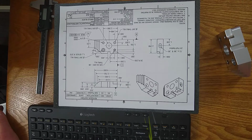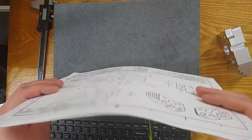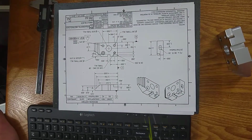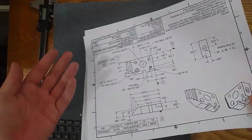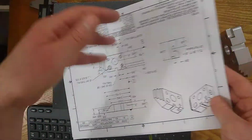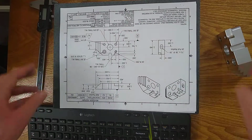So the programmer, once he does get the revision, doesn't have to look at every single line of code and look for the changes. He can focus on just the changes that were there. Code can become thousands of lines long on CNC applications. Same thing with machinists. He gets a print. He's been making the part for years. He's just going to focus on the new pieces. Same thing with the inspector. It's like, oh, there's a revision. All right, I'll really focus on this part and make sure that the revision happened correctly.